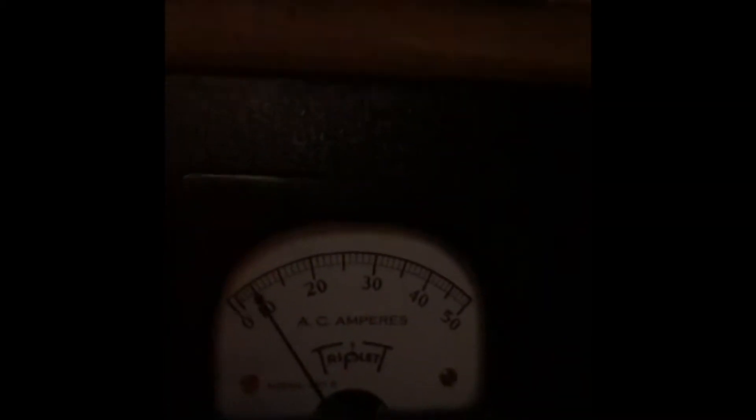The lights are off now. I will turn the plate on and slowly increase the filament power. As I do this, the RF emitted by the coils shall illuminate those bulbs near the bottom center. The brightness of the tube is increasing, and now the tubes are illuminated. Right now the filament power is at roughly 8 volts at 10 amperes. We shall increase it now to 10 volts, and we can see formations in the bulbs appearing.